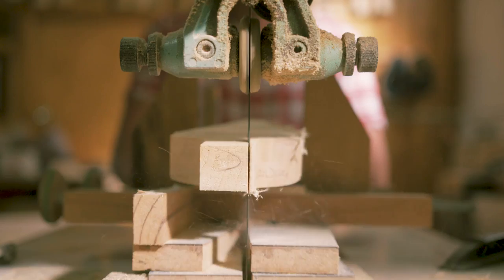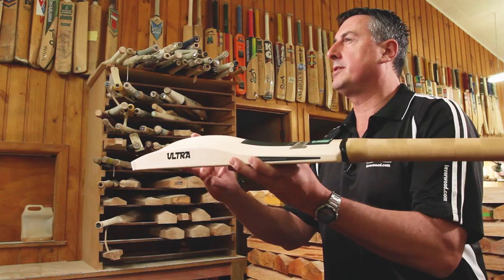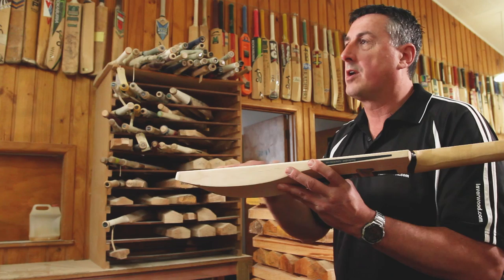When making a bat for sheer performance, the crucial parts are the pressing and the selection of timber for density. When selecting a piece of willow, you're looking for a specific piece that matches the shape required — the right cleft that matches the shape and weight of the bat. Pressing is one of the most crucial parts of the process; it's quite complex, you've got to get it exactly right and hear what's going on in the timber. Each bat and each piece of willow has different properties — with the cell structure, some cells are very open and some are more closed, which is the difference between low and high density timber.